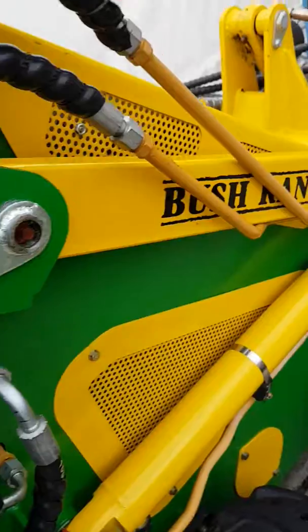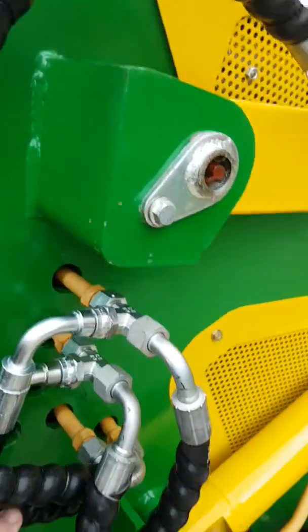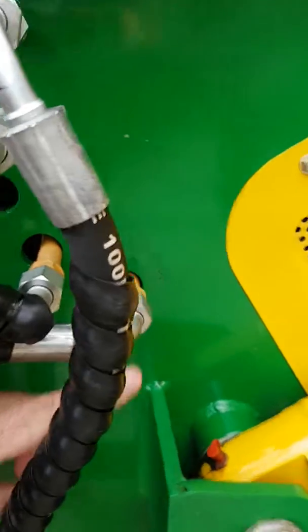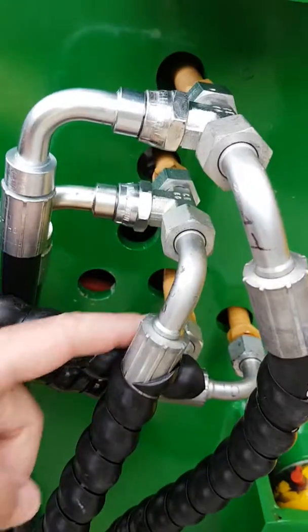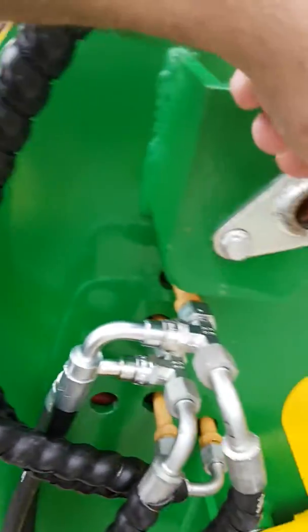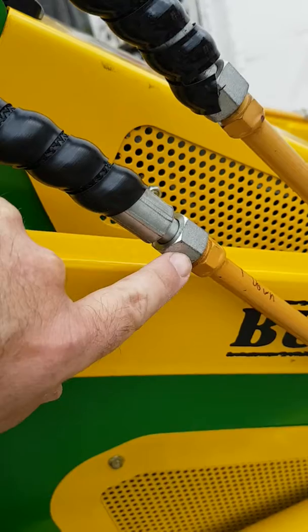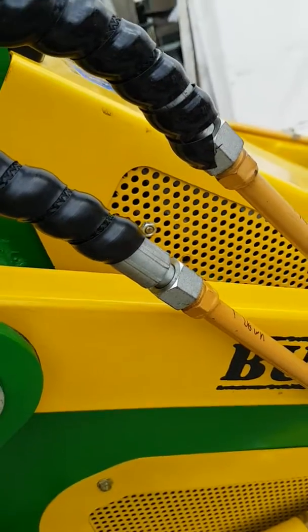With your top coupler, we'll just trace it back — that comes all the way down to the very bottom outlet. The next one up goes to the next coupler down, which is over here. That now affects the way the machine tilts the bucket.